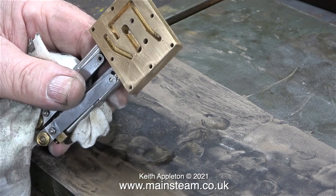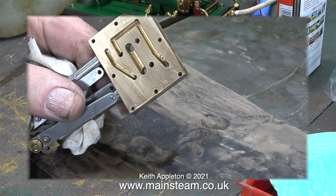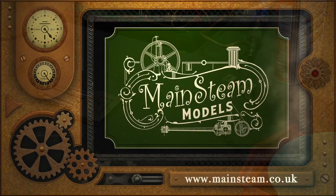Here I'm cleaning up the part using gun wash, and this time I'm not dipping my fingers in the pot. This is the underside — the part of the mechanism that allows the changeover so that one valve operates the other cylinder. I also gave this a good rub on the wet-or-dry sandpaper because when I first did it the part was actually concave, but now this very important part of the pump is flat on both sides. This job really did take a long time and was very tedious, but cleaning up parts manually is a good skill to learn.